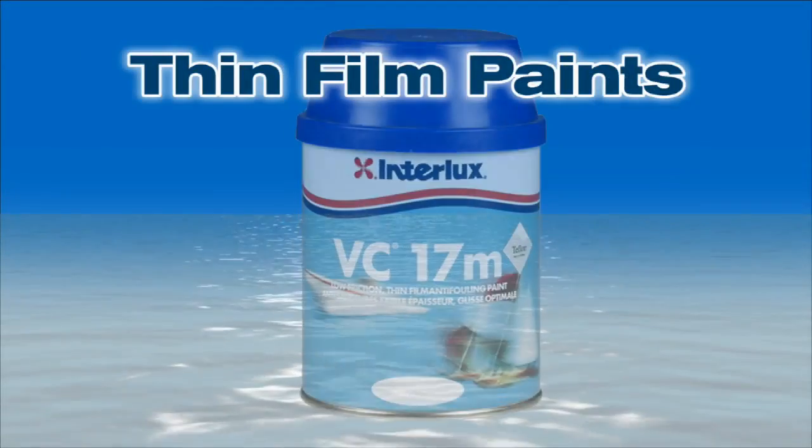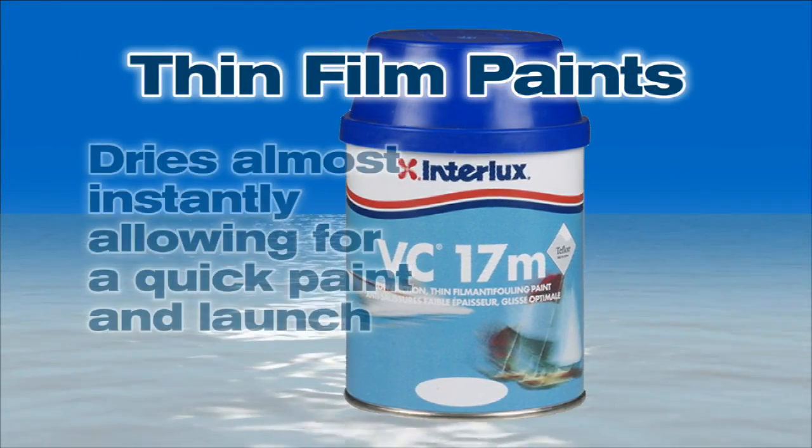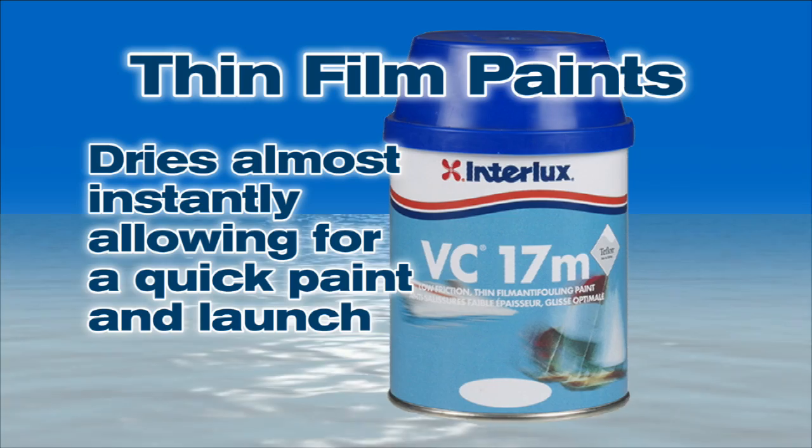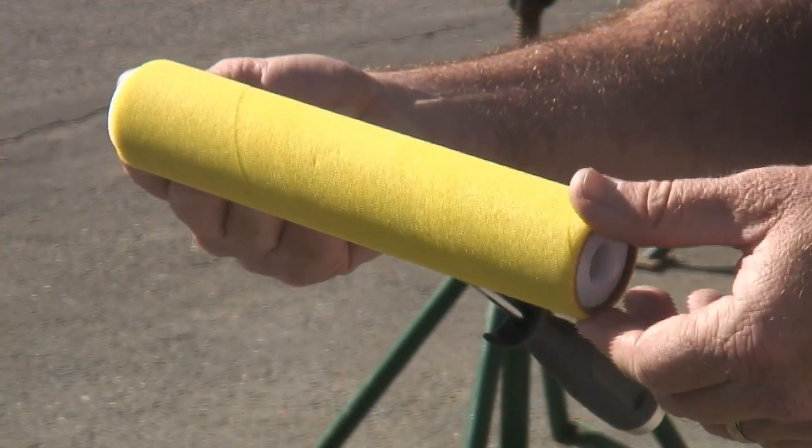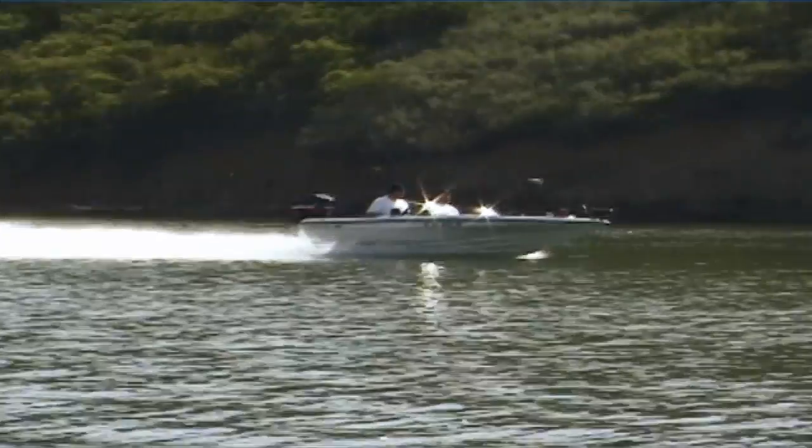The most popular thin film paint is Interlux VC17M. This paint dries almost instantly, allowing for quick paint and launch, and because they're so thin, they must be applied with either a solvent-resistant foam roller head cover or by spraying with an airless sprayer. Again, these paints are only effective in fresh water.